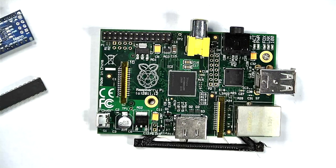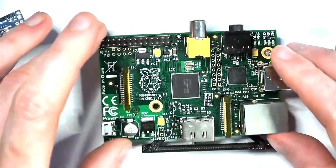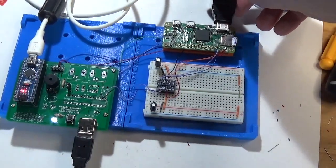That said, we did get there with Tiny Basic for Color, which gave the original AVR ATmega 328P architecture color and USB support — be that via the inclusion of a Raspberry Pi to act as a dumb terminal and USB keyboard driver. I even went on to build a test rig system allowing use of SD cards for program storage.